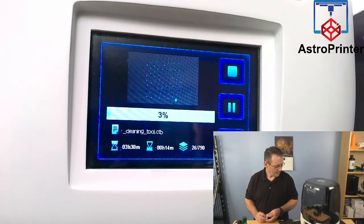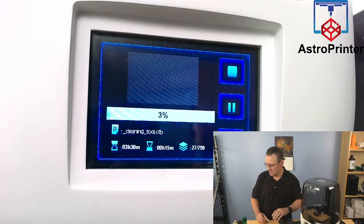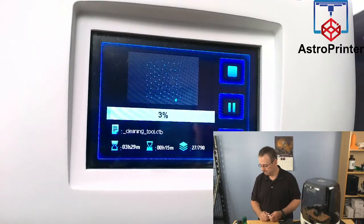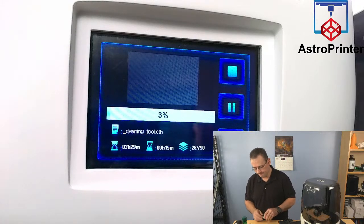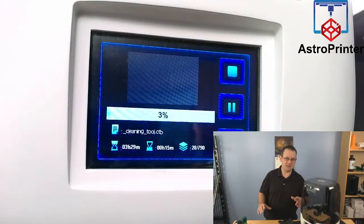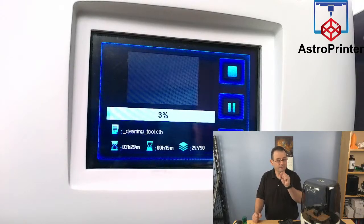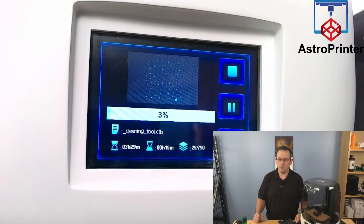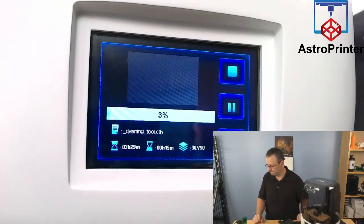But I don't know. The one thing I would change in this, I don't like the ABS vat. I really don't like ABS vats. Vats should be aluminum. And this is an ABS vat. I know it saves money, but I've seen with another printer, which will be nameless because I was asked to beta test it, not review it, that I found issues. When I used an ABS resin in the ABS vat, it dissolved some of the top coating of the vat. Normally I wouldn't mind, but the lining of the vat melted because of the ABS resin.